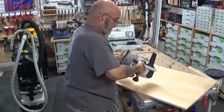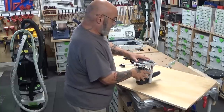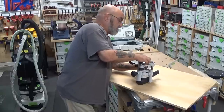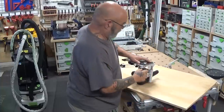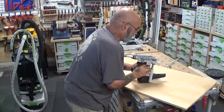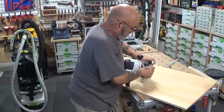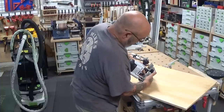Okay. So get it back, plunge it through until it gets right through this piece. Keep it about center. And then tighten up both plates really good, both screws really good. Now, you don't need the centering mandrel no more. There's a little tough in there. Lock this back. And then this will come right out. You don't need it. Now you're set.